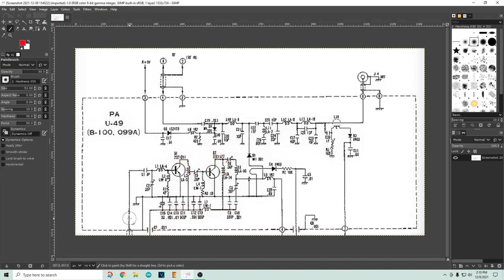The RF data path is passively coupled in here. There's a capacitor to ground for impedance matching, then some inductors for impedance matching — so this is an L-network coming in, or maybe even a PI network. It comes into the first transistor, gets amplified, then gets amplified a second time by the second transistor. After that it follows this path through a low-pass filter, and then it goes out to the antenna.